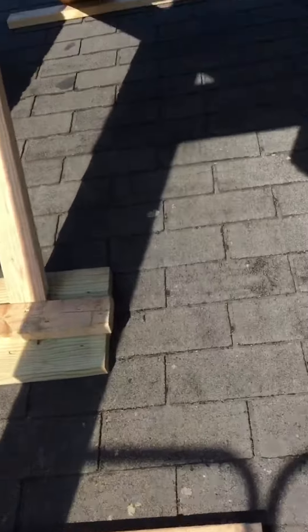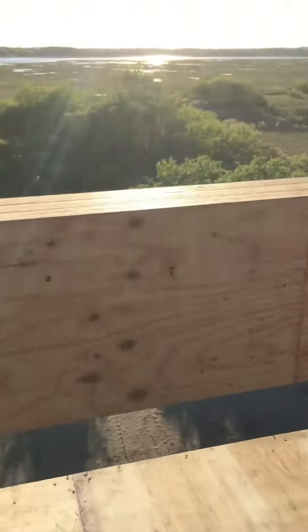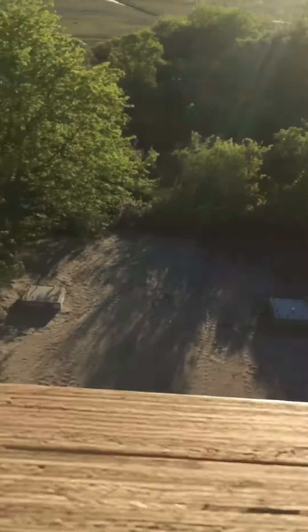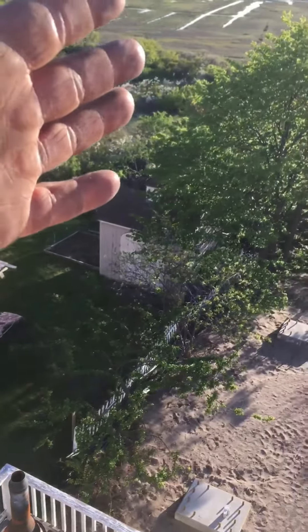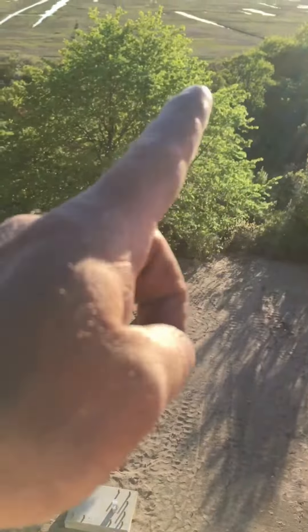Here's the staging so we could get up and put that header on. There it is — an LVL 14-inch header. We left a little pocket over here that's going to accept the LVLs that are going to span 21 to 22 feet out to meet the addition. And this is the roof.